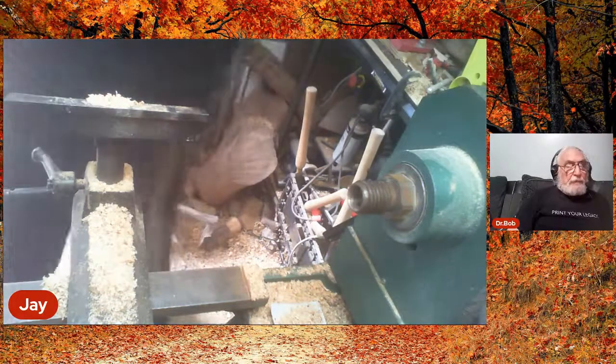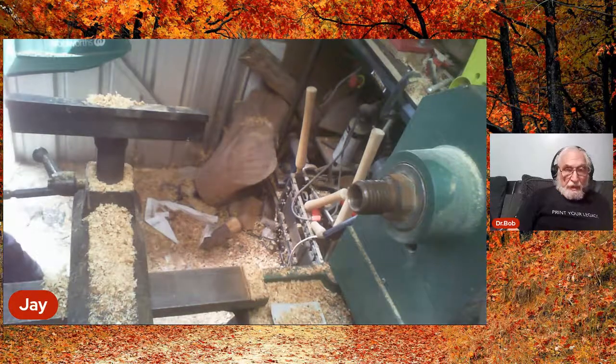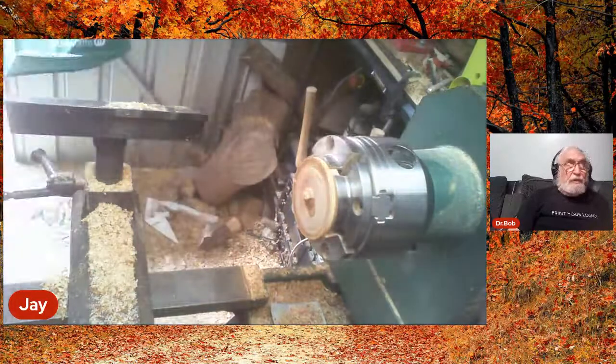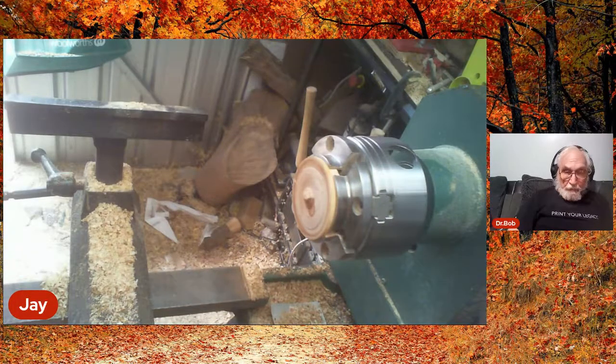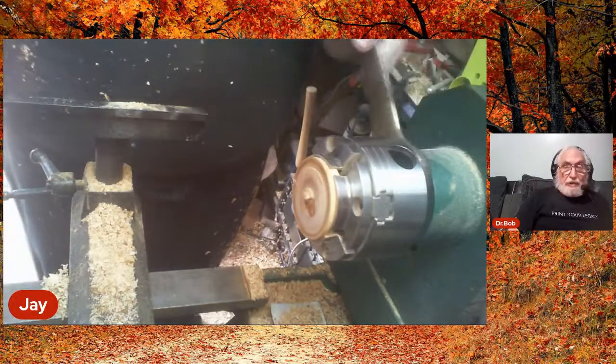But a machinist saw is far more accurate because they expect to measure down to the millimeter. And woodworkers, there are several grades of saws. You've got the hobbyist, which is the small, cheap ones. You can tell the wheels are pot metal. You don't want them at all, because if you tighten them to where they should be tight enough for the blade and forget to take the tension off, you can warp the wheels. And usually they're China made, so you can't very easily buy parts.